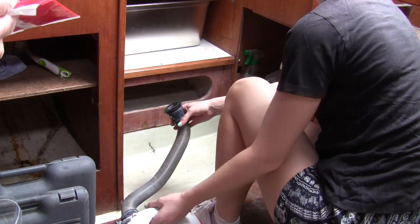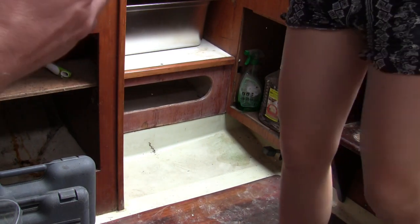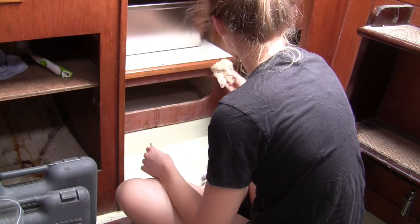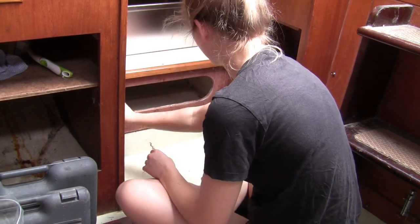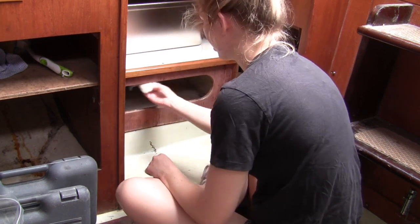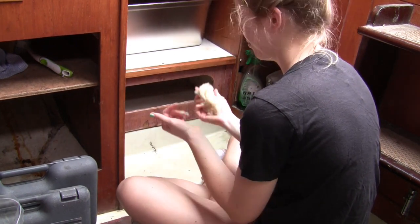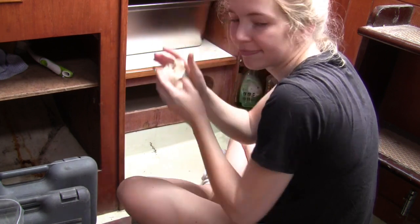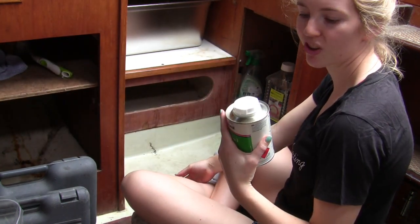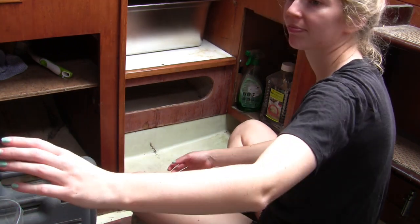There's a tack cloth. Just scrunch it up and go over it briefly with a tack cloth. And then I think what we'll do is give it a quick wipe over with No. 1 thinners. That'll do. Don't press it too hard. It's mainly to pull the dust off. But I don't know what order you're supposed to do this in. I've got no idea. Nobody knows. Should I have got a separate brush for the thinners? No, it's just wipe it on like you would acetone.